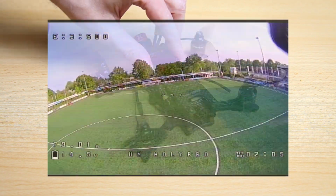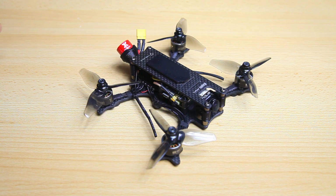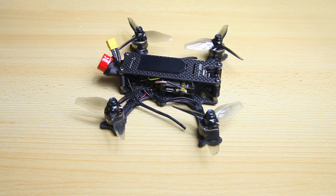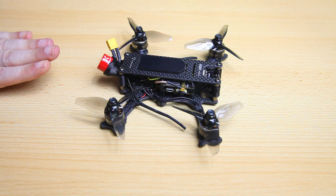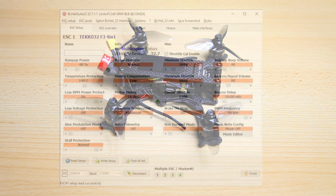Then there's the twitch, basically an ESC desync. I've done a lot of PID tuning on this quadcopter, but that twitch has nothing to do with the PIDs. You need to go into the BLHeli 32 suite, and I'll have a link to that program in the description of this video. It's a separate program.